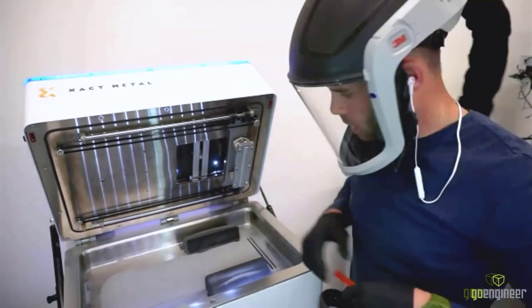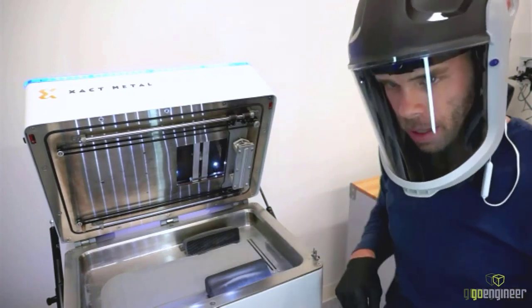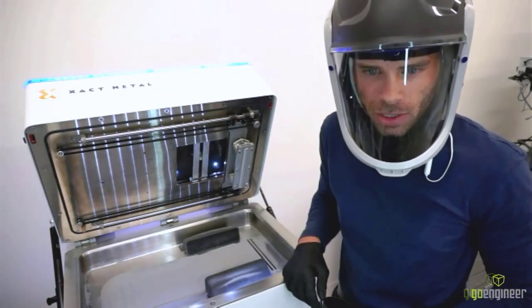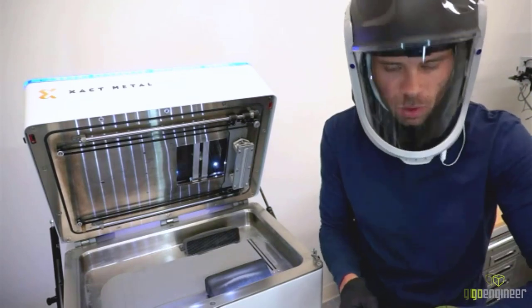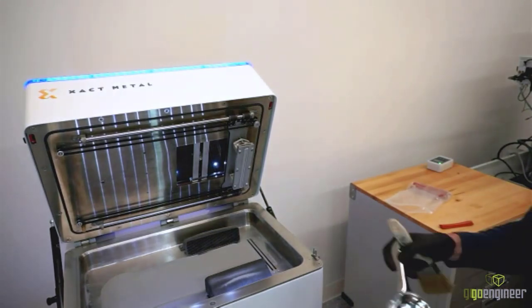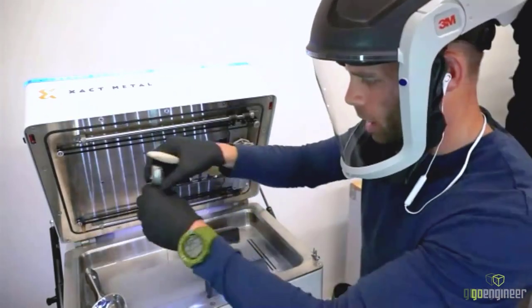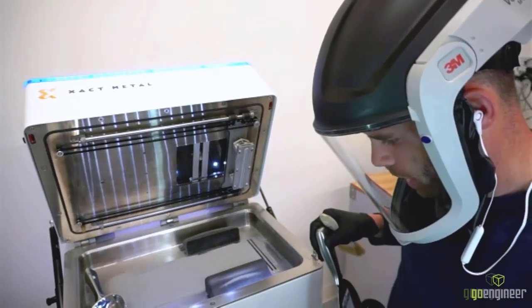While we have this open, we have two vents here — this is the path of the argon drape. Argon flows over the powder bed to help inert the system and carry away any soot generated when the laser hits the powder bed. I'm going to start moving this print up. I'm not going to fully excavate this because we don't really have time, but I'll show you what it looks like.